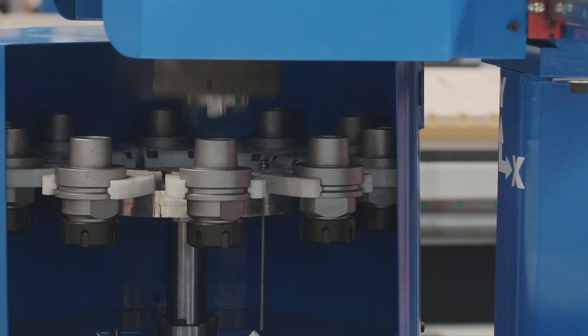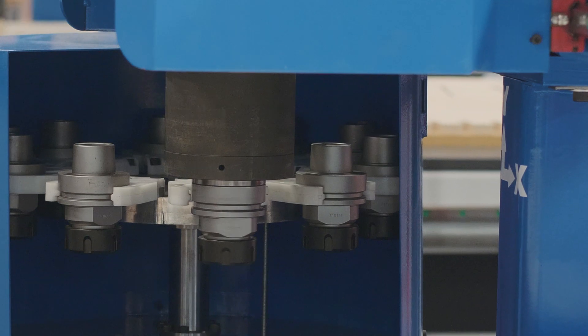In terms of the positioning problem, we use the same technology we use for moving the machine. We put a Mitsubishi closed-loop glass-encoded servo to actually direct-drive that tool changer, so the machine control constantly knows exactly where it's at. It's extremely powerful so it spins really quickly, and it can go in either direction so the control always takes the closest path to the tool. What that amounts to is really, really fast chip-to-chip machining times.